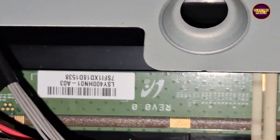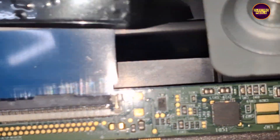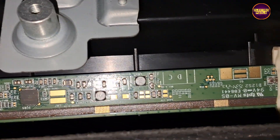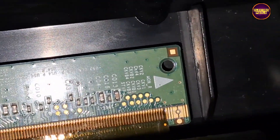This TV comes with a full HD Samsung panel with a DC to DC IC. Due to internal shorting in gate signals, this IC goes to protection mode and because of that it doesn't generate any basic panel voltages.